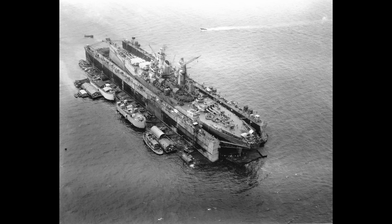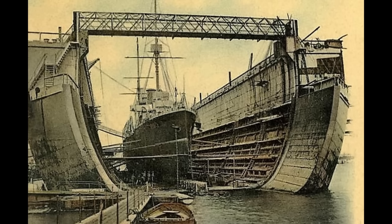Now you've taken the ship back as far as you're likely to do, you actually start making repairs. Smaller damage — machine gun rounds, cannon rounds, splinters — if you've got a 15-by-10-foot section of superstructure plate with only a two-inch by one-inch splinter hole, there's no point taking off the entire thing. It's not armour plate, it's not structural. You can just weld or rivet a little spot plate over it and the job's done — the thing is sealed and has as much protection as it ever did. Plate over the smaller damage.